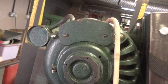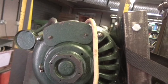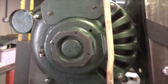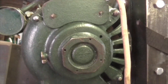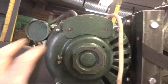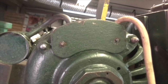To reverse the motor it's the polarity of the start winding you change. It depends what it's marked - in this type of motor it's usually Z1 and Z2, but sometimes they use UV and W, or W1 and W2 that you swap. I've also wondered about turning the motor end caps so that the oilers are up, which I can do at the other end but I don't think I can at this end because of the wiring. When I get that cover off I'll be able to have a look.